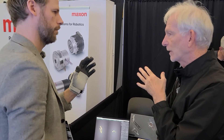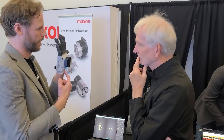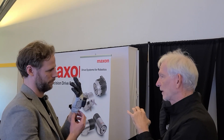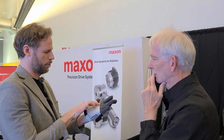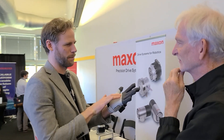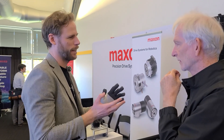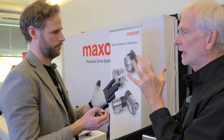How many degrees of freedom does a human hand really have? It depends on how you structure it. If you don't count the wrist, you end up with 22 degrees of freedom. Include the wrist and it's 25. Sometimes you hear 27 — but a lot of times when people say 27, they're actually including the wrist. These two metacarpals can technically rotate on a 3D plane, but they never really do in practice. So from a practical standpoint maybe 25, but if you're building a hand it ends up being 21 or 22.